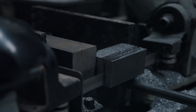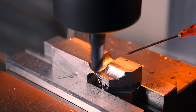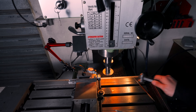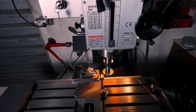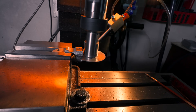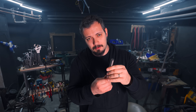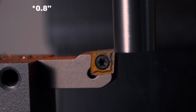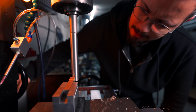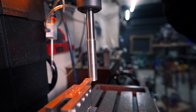The second time around I used the saw to cut the stock to size, and I actually made some improvements in the design to have the front clamp less stiff and to make the shape flow better with the base. I even used a drill bit with a point this time. I didn't have much surface to index the piece flat on the parallels when slitting the back, so I used a dial test indicator to sweep these two faces parallel to the machine table. Which leaves us with the pole — I tried to order it online already ground to the right size, but both attempts failed. A buddy of mine procured me a piece of 20mm stainless, which I then turned down to the right diameter, making the best of what I had.